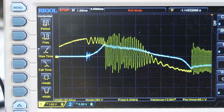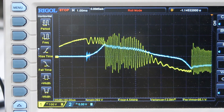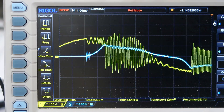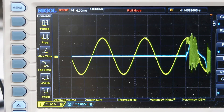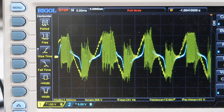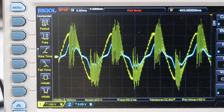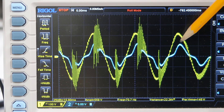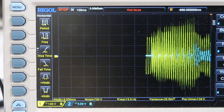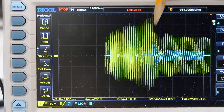This is the very first cycle where the saw turns on, and we see some voltage instability and the current rises up to 5 volts, meaning 50 amperes. Then the overcurrent protection kicks in, and we see the current is held relatively steady, but the voltage goes crazy because it's an inductive load, and turning the voltage on and off doesn't switch the current that quickly. Zooming out, this goes on for quite a few cycles and actually gets even worse. We also see the voltage exceeding where it should go, until finally we get back to something relatively normal because the current is now much less, although that current is still peaking out at 50 amperes. At 100 milliseconds per division, the duration of all this instability is about 3 and a half divisions — so 350 milliseconds.